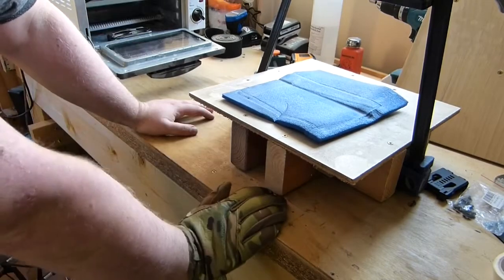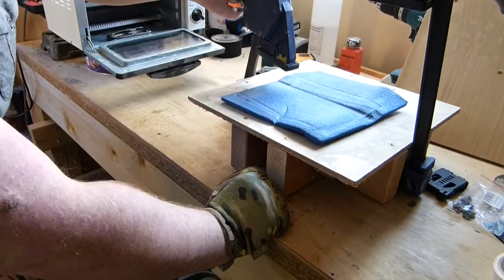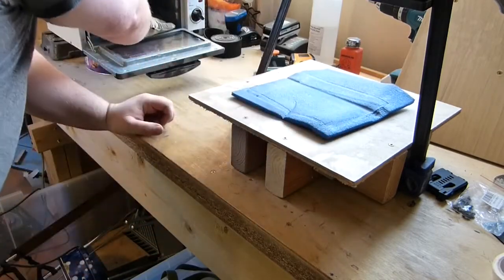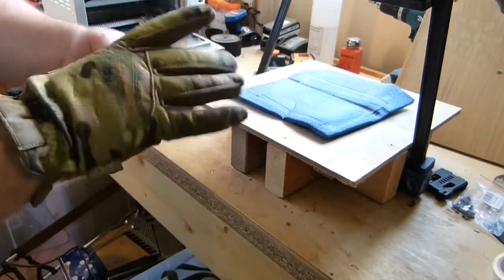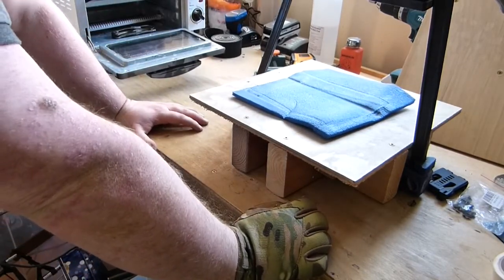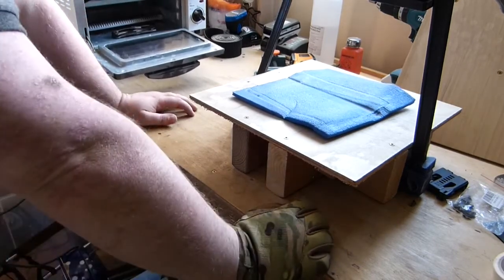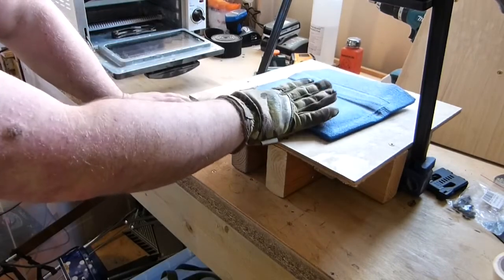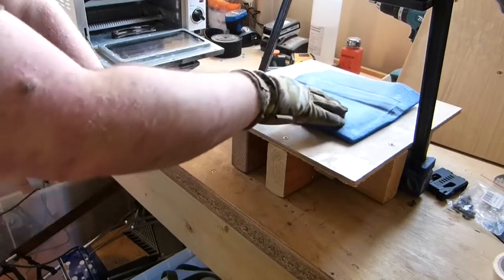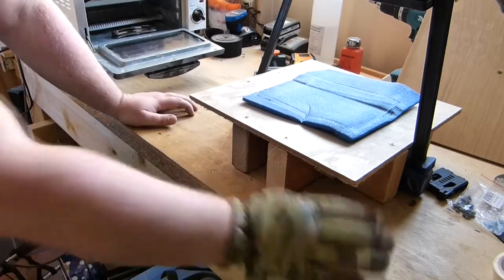Just very quickly while this is all heating up in the oven - this is the press I've got. It's basically just a base, a lid, and these sliding clamps slide down onto it and give it the pressure. There's a million of these all over the internet. I've taken the knife and sellotaped the wooden block onto it. This is currently sitting in the oven, not at any high heat, just to put some heat into it so I can get a little better definition. I've also got the foam sitting on top so I can put a bit of heat into that too. The Kydex is just about ready to come out. I've put a single sheet on the bottom because I want the bottom to remain mostly flat, and then three layers on top. I'm also giving this cheap foam a try - I usually use a nice silicone foam but I've never given this cheap stuff a go, so let's see what happens.